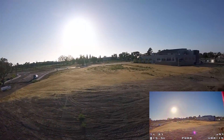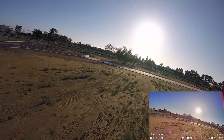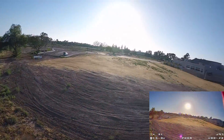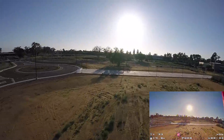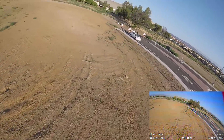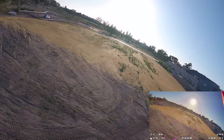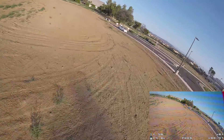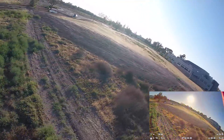You can tell that it's a little loose on the roll axis. I think because of the extra weight of the GoPro, I need to increase the rates on the roll axis as well. Pitch axis seems okay. These E-Max motors have a lot of power, even carrying the extra weight of the GoPro. This is a much heavier quad. Wow, and they scream.